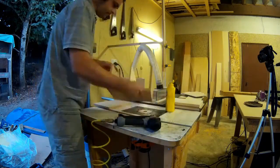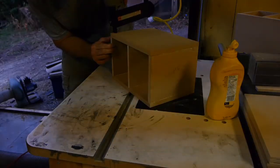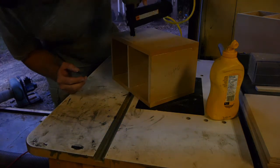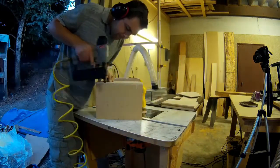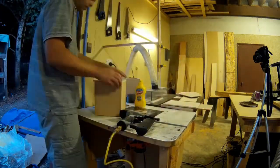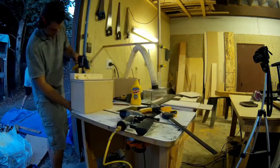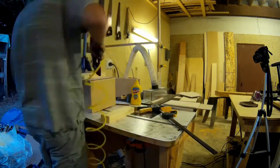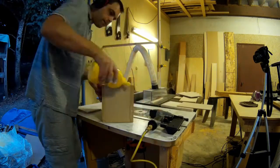I had to be really careful nailing the brace because it's just 3/8 Baltic birch — the rest is made out of half-inch MDF. I figure I can get away with such thin material because the boxes are so small, and that's also why I figure I can get away with one brace. Notice how I set the pin and then move my hand out of the way right before pulling the trigger — that's super important. I have had stray nails run out of the wood before. Here I am attaching the first piece of the baffle — the 3/8 Baltic birch — and now the quarter-inch MDF. I nail the quarter-inch MDF just to keep it from sliding, but I clamp it because I need pressure in the middle of the baffle to sandwich the layers together.